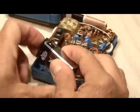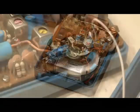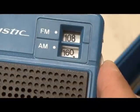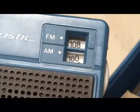Now that we've identified those parts, we need to put a battery back in if you had to remove yours to get the case open. Then we're going to turn the radio on and tune to an FM station at the upper end of the FM band. Take note of the dial position because we're going to see how that changes in just a second.